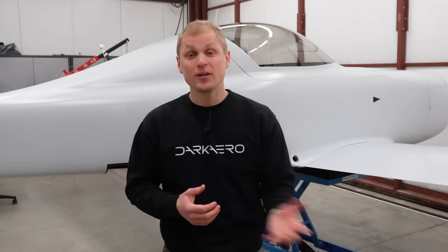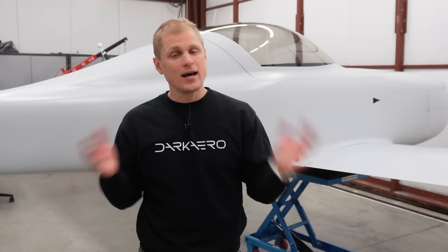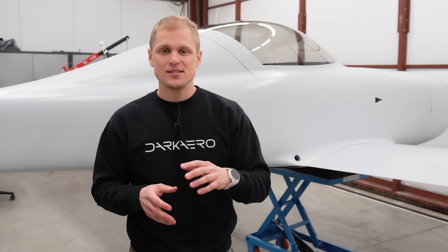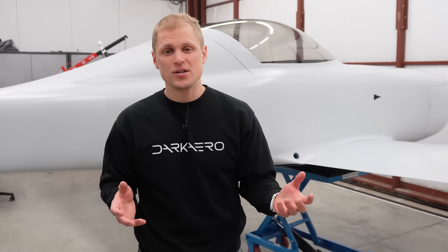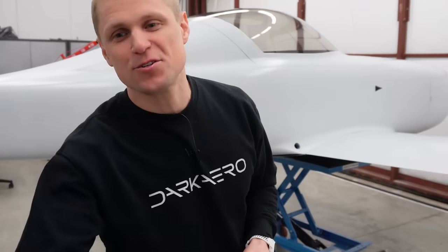A couple of people have asked about clear coating the airframe. The idea with clear coat is that you get to UV protect the carbon fiber structure while still preserving the carbon fiber appearance. We have been testing some clear coat options in parallel to the whole painting operation, but there are a couple of challenges. There are a lot of options for UV-resistant clear coat out there, but not many of them are validated to an aerospace standard. Most clear coats degrade over time, which is normally fine for consumer or automotive non-structural parts, but this degradation would be a problem for our airframe. We want to find something that can really last a long time. We did test it on a couple of test parts as well as on the flaps — I'll show you one of those now.